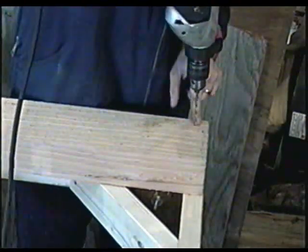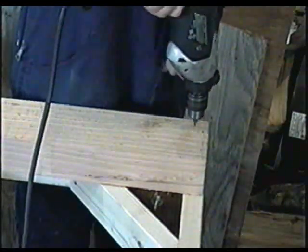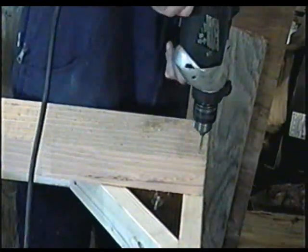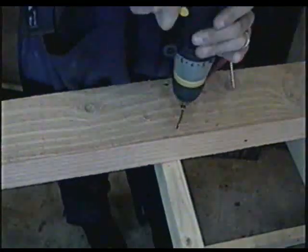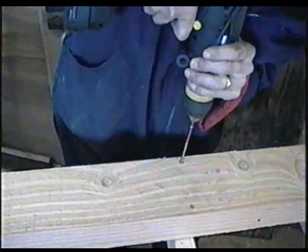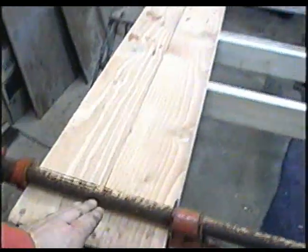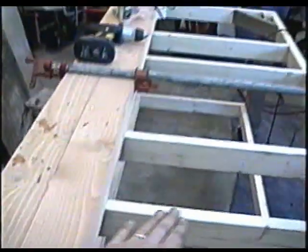What I'm gonna do here is pre-drill the holes where I'm putting the screws because the wood may crack. You just drill a smaller hole than your screw and then when you put the screw in it's not gonna crack the wood. In some spots the lumber is not quite even, so where it cracks I put some glue and I've got these clamps holding the lumber together. When it's dry I'm gonna release the clamps and keep adding the wood.